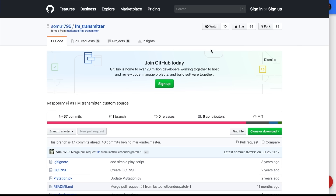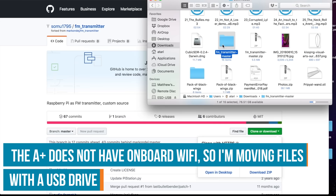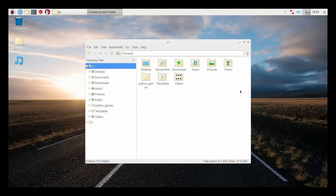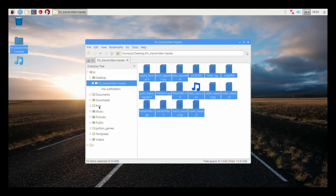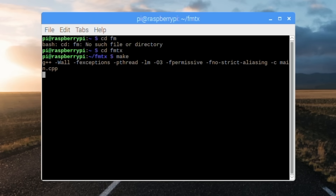Now that we've got the Raspberry Pi with Raspbian all installed, we've got to get the script down from GitHub. We're going to download a zip of our transmitter application. Jump drive in — let's create a new folder here. We're going to call it FMTX, and we're just going to copy the contents of this folder. Now I'll open up the terminal, cd to that new FMTX folder, and run make. That's going to compile the software so that we'll be able to use it on the Raspberry Pi.